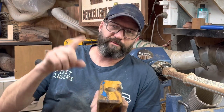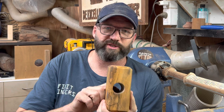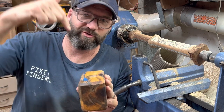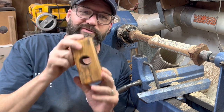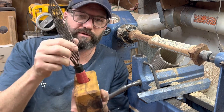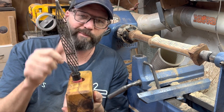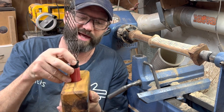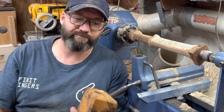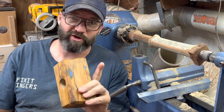Quick confession time: this hole is awesome, but this one is cocked off to one side. I used a drill press on this side and then continued with a hand drill — it took its own path and didn't pop out square. So my handle is going to be crooked. I've got to come up with a way to straighten that and camouflage the fact that this hole is not in the middle. It was a fair balls-up, which is a shame because that's a cool mallet head — hopefully I can recover it.